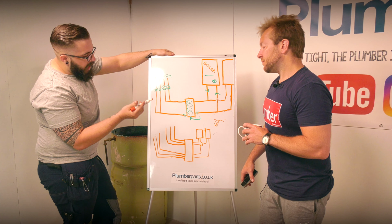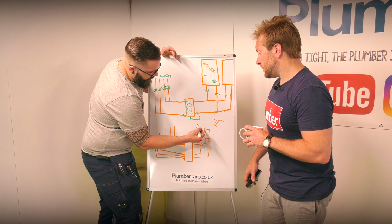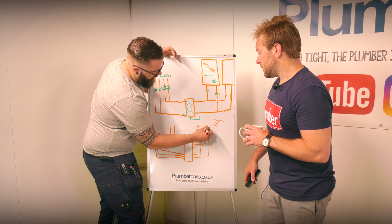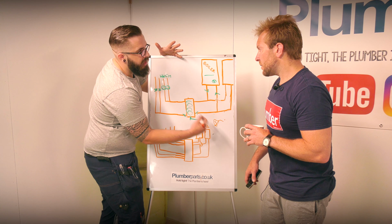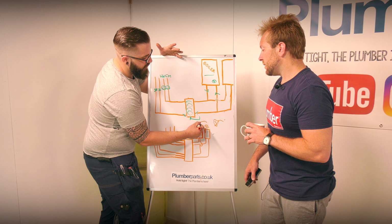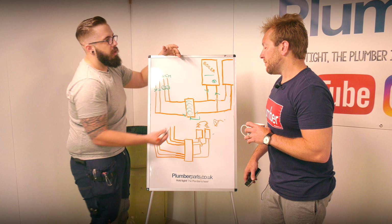Yeah. For example, what I'd do is I'd have this one set at 70 degree flow, and this one at 65. That's just a rough number. And then every year when you're there to service it, switch them over, so you've got one working harder than the other all the time. So that way you've got backup.